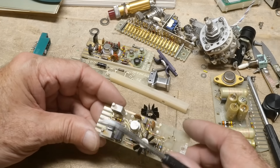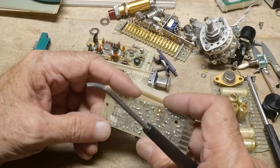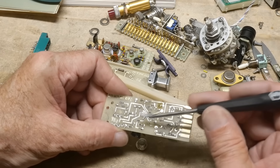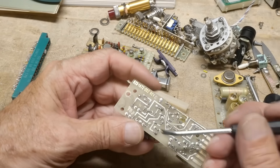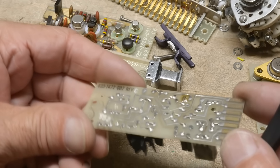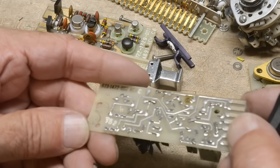It's real brown and crusty now, so I'm not sure what they used — their shellac or something, kind of strange. Maybe 1975. So here's a great example of a dual-sided PC board and how you mush the leads over before you solder them down. Back in the old days you would do that — makes it hard to work on, but yeah, smash them down, solder them down.